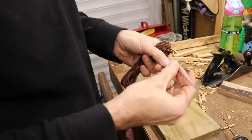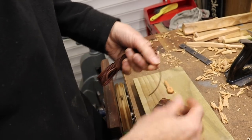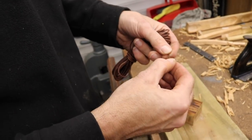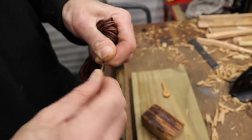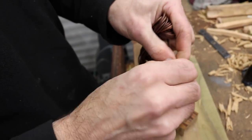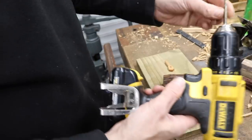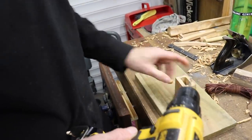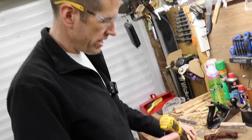So that's about 2.5 mil, so I've got a 3 mil drill bit to let the cord through. But then when we put it inside we want a knot to locate it in place. So if you think about when you've tied a knot in the end of this, that's going to pull down to be a bigger thing, and we want to kind of accommodate that knot in a little hole to make sure it stays in. So what I'm going to do is take a 5 mil drill bit, and remember I went down the centre of this with the Forstner bit. There's still a tiny little mark,